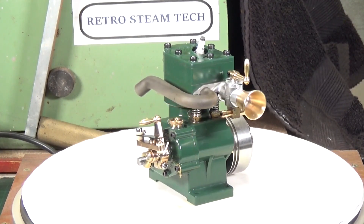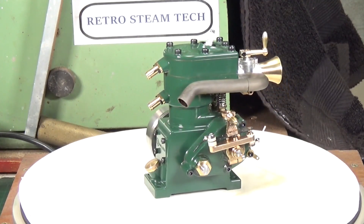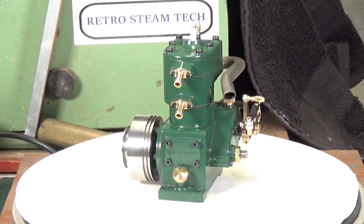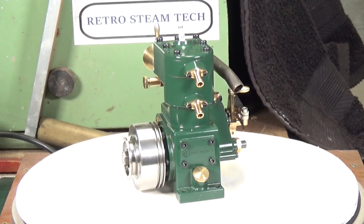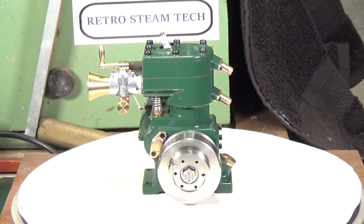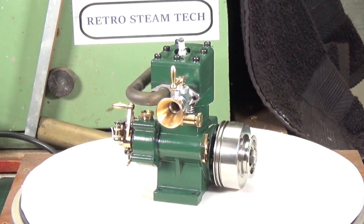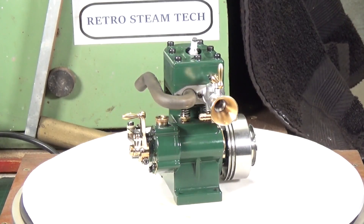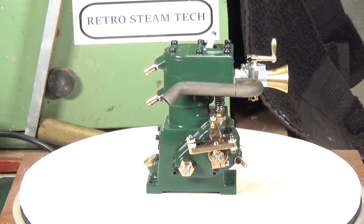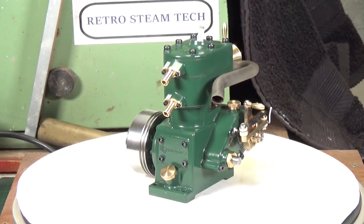So what is it? Well, if you've watched my favorites video or the review of this engine, you'll know that this is a Chinese-made 10cc single-cylinder water-cooled four-stroke petrol engine. It's based on a design by Edgar Westbury from the 1960s, who called this engine the Whippet. From now on we're going to call this the Whippet engine. I'll put a link in the description to Sterling Kit, which is the website where you can buy this if you've got loads of money and want one.